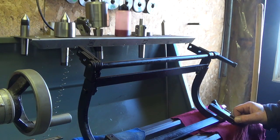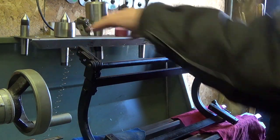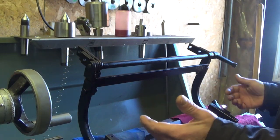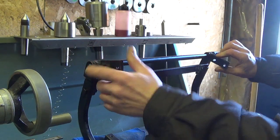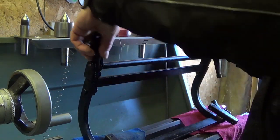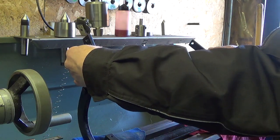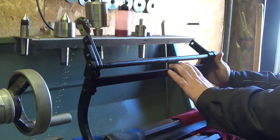So this is our completed assembly for the keyboard trays. How we got it geared up, of course, the two back pieces mount into the console itself with a couple of bolts. So all the controller has to do is loosen this handle, and he gets a full 180 degree pivot of these hinges, so he can use it from a standing or seated position. And when he gets his tray to the height he wants, you just turn this handle. It's resettable here because there's not a lot of clearance over top, and you tighten this down and you have it locked very securely.